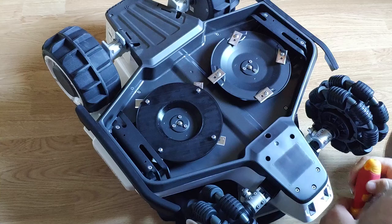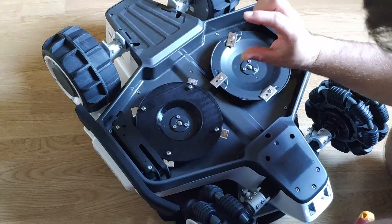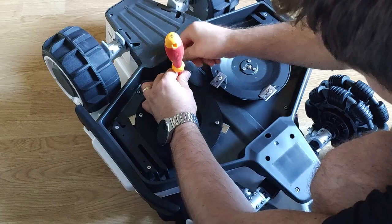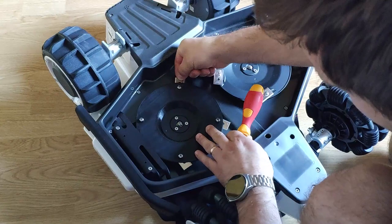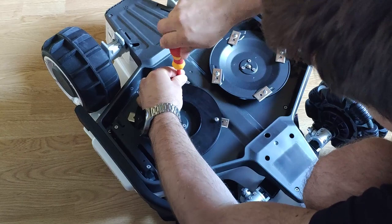And now the most important part. When you tighten the screws, you must wiggle the blades, because the flat part on the screws sometimes pinches the blades and then they won't move freely. So when you tighten it, give it a little wiggle. If it's stuck, slightly unscrew, wiggle the blade so it jumps into place, then tighten firmly — screws are hard but blades remain free. Repeat for all four blades.